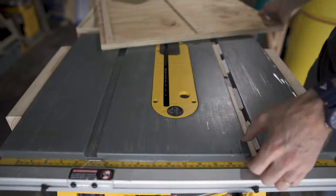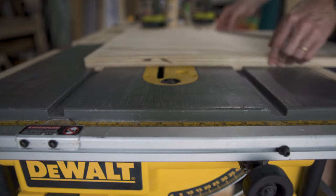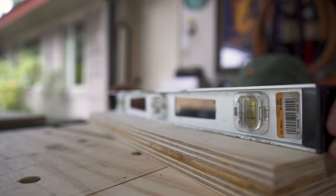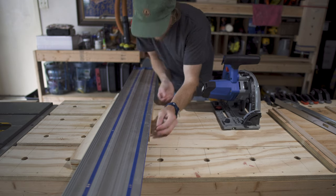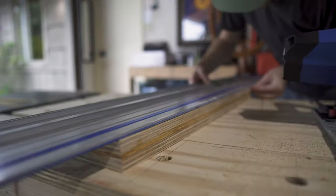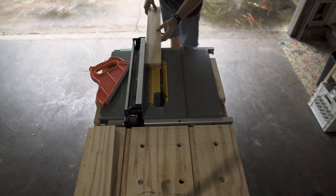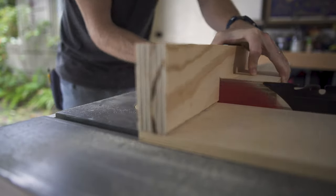Test how it slides immediately. If something is off you want to be able to undo it before the wood glue has really dried. If the runners are too snug you can carefully sand a little bit off those inside edges. At this point my fence pieces have had ample time to dry and we can unclamp them. The straight edge did its job and the back fence came out perfectly flat. Now I'll use the track saw to clean up one edge on each of the fences. If you don't have a track saw you could also use a circular saw and a straight edge, or a table saw and a jointing sled. During all this be sure to watch out for the brad nails in the corners — position them more than a quarter inch from the edges to avoid any problems.